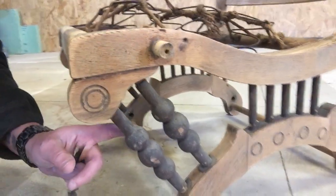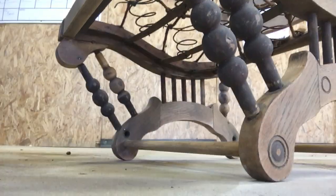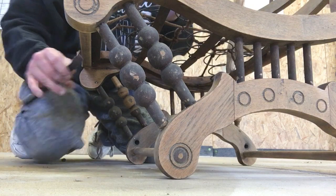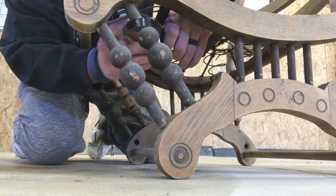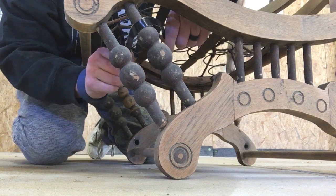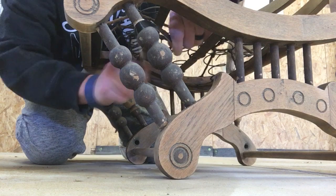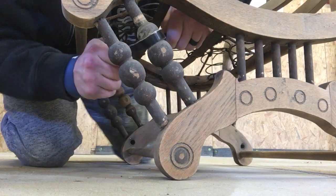These little things right here — they look like fun, don't they? Not really, but it's going to be awesome when I'm done. So what I'm going to do is take my duct-tape-backed sandpaper, put the sandpaper side against the spindle, wrap it around, and just like shining a shoe, go back and forth. That's how you get into all those crevices.